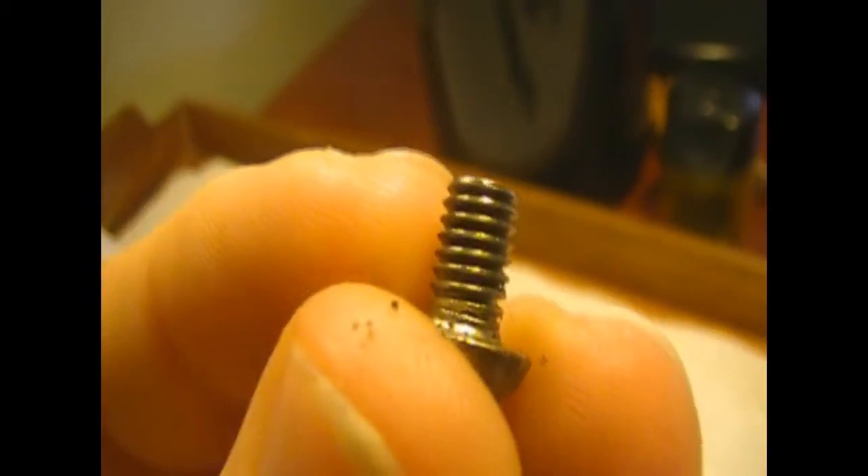The crank screw is made out of low carbon steel. It is extruded through a set die and cut to length. It is upset forged to make the head and is externally threaded. The slot is plain milled.